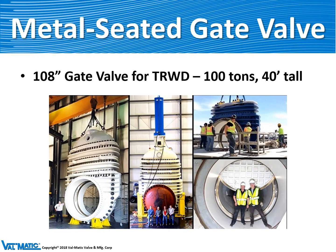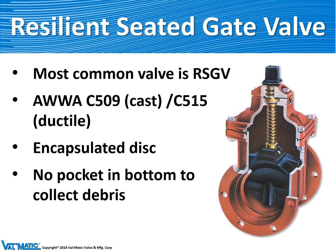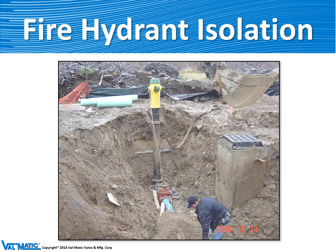Because of those slots, gate valves probably should not be used for wastewater either. Gate valves can become quite large — here's a 108-inch gate valve for a Texas project. Gate valves also come in a version that looks like a plug valve with a rubber-coated gate that goes up and down, and these can be used for wastewater but once again never for throttling the flow. They are commonly used next to fire hydrants.